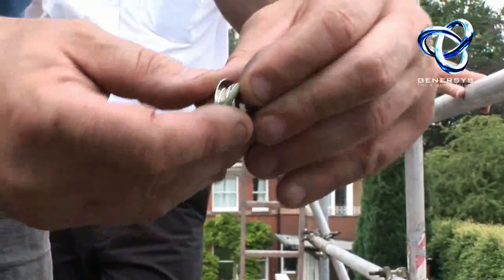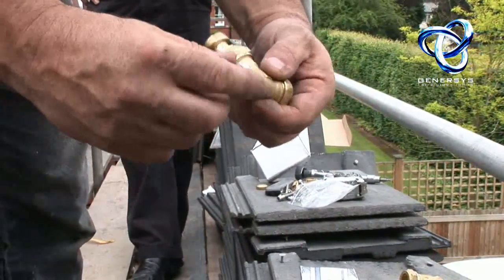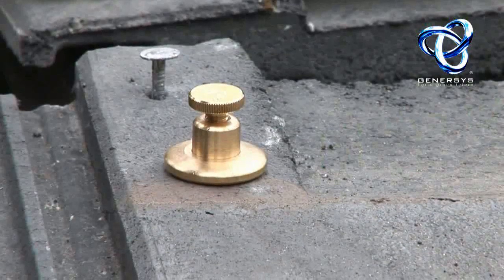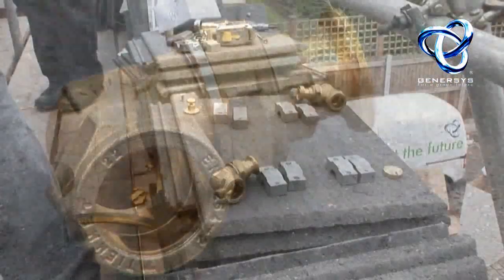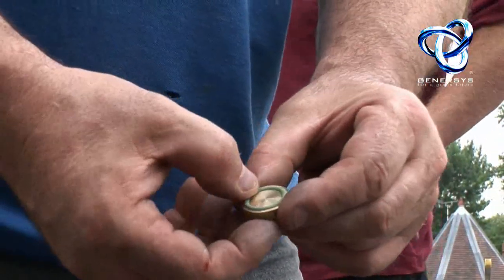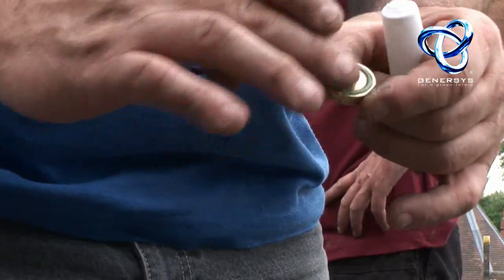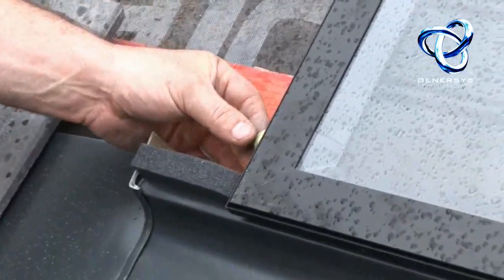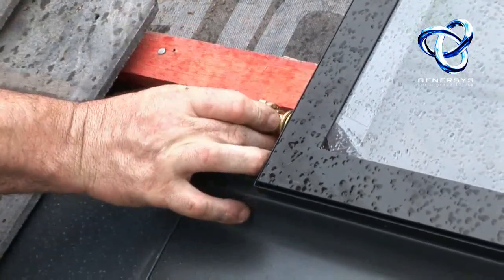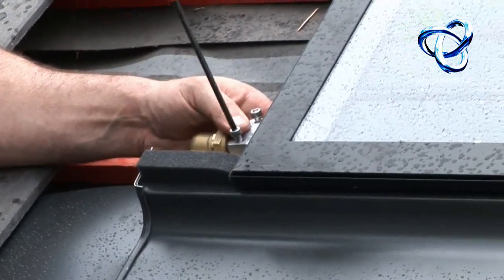We cap off the end of the panel using a green solar O-ring. Don't forget the silicone gel supplied with every extension and installation kit. Here we are fitting the installation kit to the bottom left panel, again using the clamps and tightening a little bit at a time on each side to clamp it together.